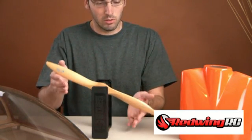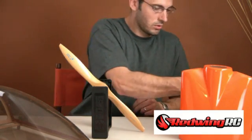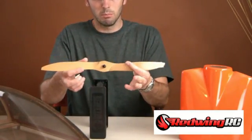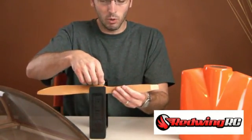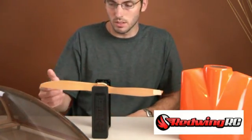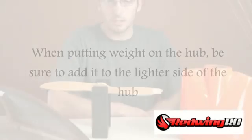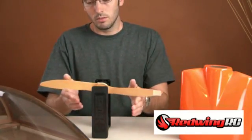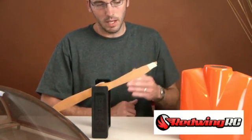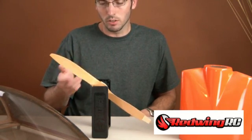So if the low side falls, the top is heavy. We're going to add weight to the bottom — I'll flip it back around so the bottom is now on top and begin adding weight. At the hub you're going to have to add more weight because it's closer to the center, and there's less leverage. We've added a little bit of weight to the top here. If you tilt the prop and the high side falls, then the bottom is heavy. I turn it this way — the high side falls again, bottom is heavy.